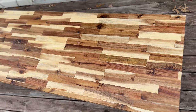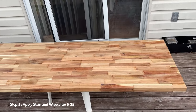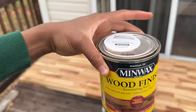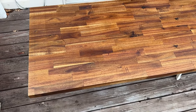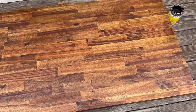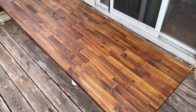After waiting 5 to 15 minutes, I wiped down the pre-stain, doing this for both sides. Then we're ready for the staining process. I did only one coat on mine because I thought it was dark enough. The color I picked was English Chestnut — it gives off warm, cozy vibes. After applying the stain I wiped off the excess, doing this for both sides. The weather was bad that day and it started to rain right after the stain dried, so I had to take it down to the basement. Check the weather first if you're doing this.